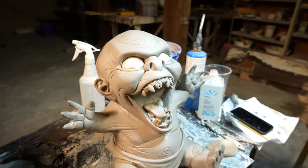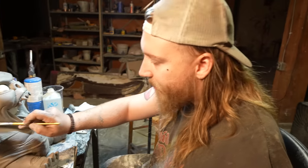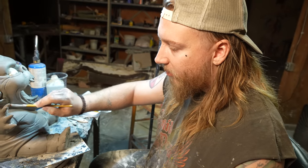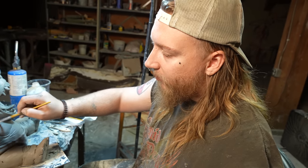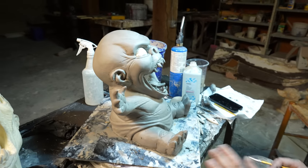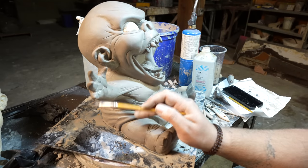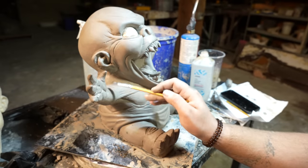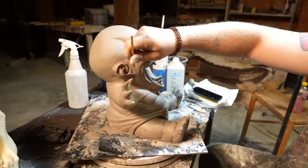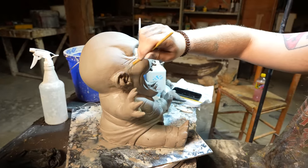And then we are going to spray the sculpture with a gloss spray paint. We like to use Ace Hardware's gloss leather brown, and we'll give it a few pretty substantial coats of that to seal in the sculpture really well. And we'll make a clay wall that will become the dividing point between the two mold halves, and then make the plaster mold.